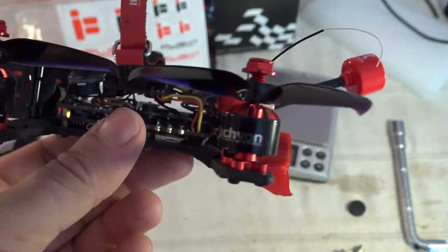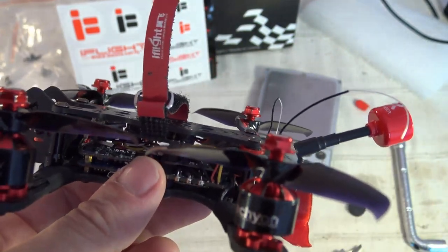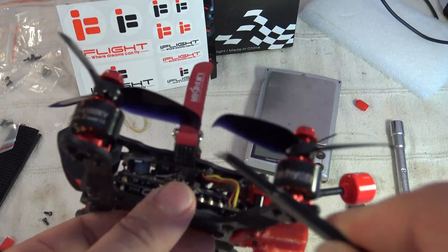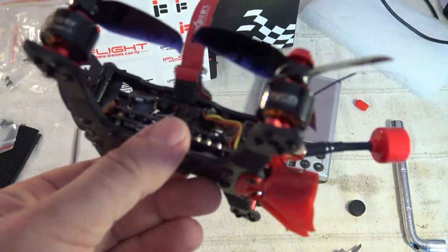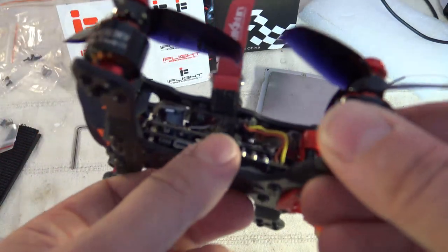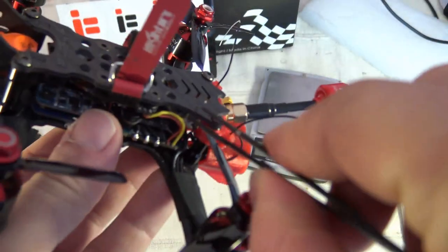And I would say, good news, the video transmitter can in theory be controlled via the OSD, because the wire between the video transmitter's SmartAudio output is soldered to a free RX input, and in this case for this board it is the UART1. And the last electronic is the flight controller F4 board. Here it is not a flip-over stack with components up and down, it is just installed like this, where we can find the battery strap, and everything is soldered directly, no connector, it is very small. In practice we have only two UART ports available: the UART1, where as I said previously the video transmitter is soldered to control the frequency, band, and output power, and the UART6 used to connect the S-bus connections of the built-in receiver. And the receiver is installed here.